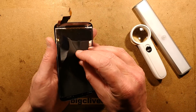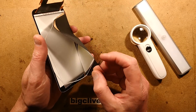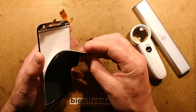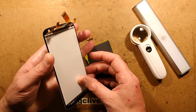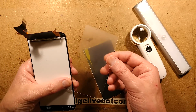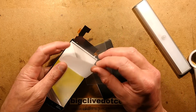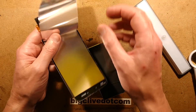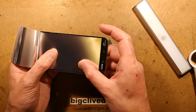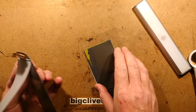I'm going to have to find a way to glue that back down. This is interesting — I've already been taking this apart so it comes off in lots of layers. It's very intriguing. It's got the back reflector layer, and then what appears to be almost like a holographic-type film — a very fine diffusing film that projects patterns when you shine light through it. There's a weird film that's almost like a Fresnel lens but as a sheet. And then you're onto the screen itself, which has one final layer of diffusion bonded onto the polariser. It's quite a complex arrangement — very sophisticated. You take these things for granted; it's just the screen of a phone.